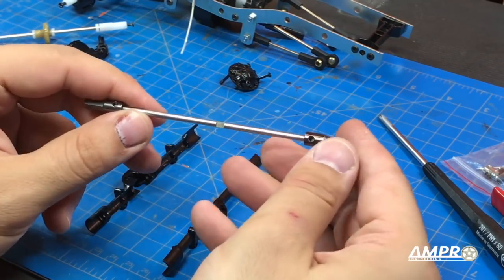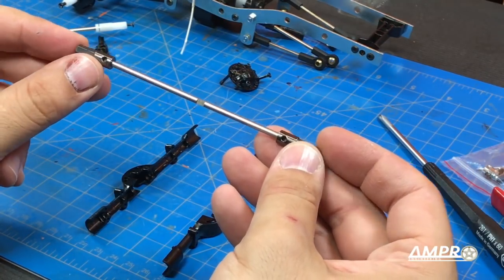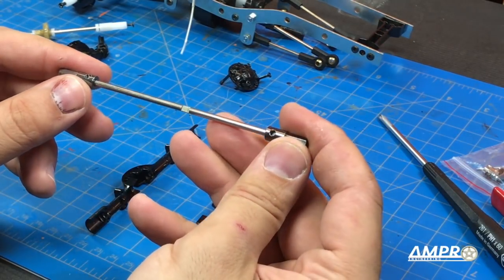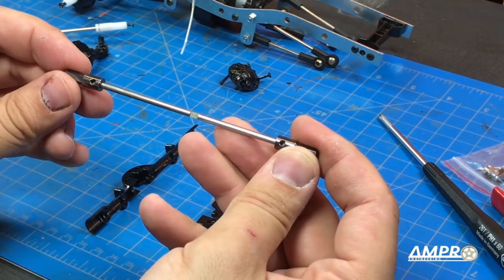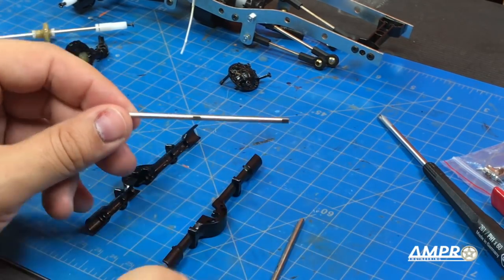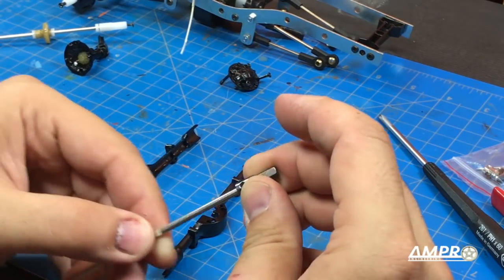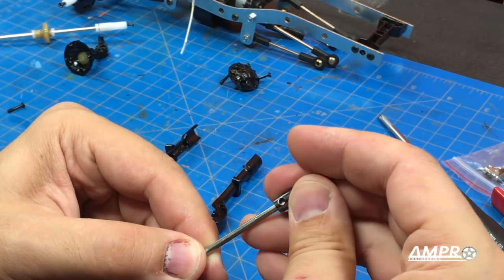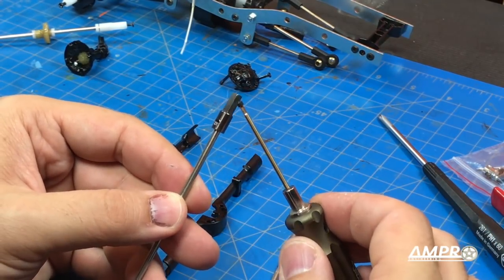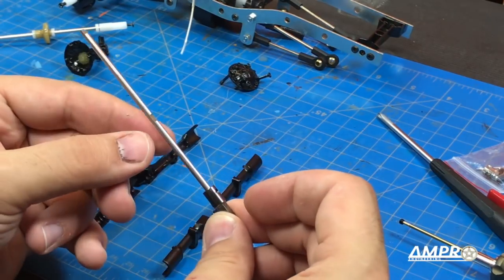The kit that I ordered — and I wish I could tell you exactly which one — there are quite a few of the exact same ones. Some parts came from Alibaba, some eBay, some Banggood, so I just don't know where to recommend to get them. But it did come with two axle shafts — a longer one and a shorter one — and this output drive that will go right there, with a little flat on it. We'll slip that in place, use some thread lock, and install the very tiny M3 set screw, then stack up the bearings and the gears from this end.